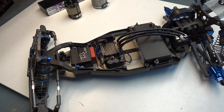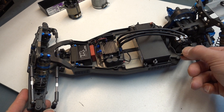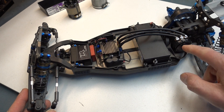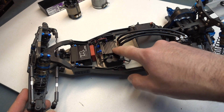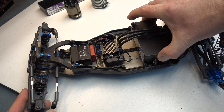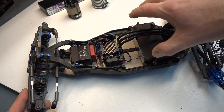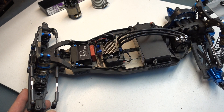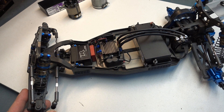Typically when we get this error we have found that either we have a damaged sensor wire or we have a disconnected or dislodged plug in the motor. The same thing happens often on the ESC side, especially in a place where we're going to take the battery in and out often. We can sometimes just catch the edge of the sensor wire and pull it out a little bit from the ESC, and that's going to give us the same error.